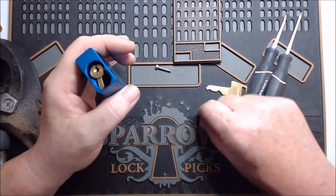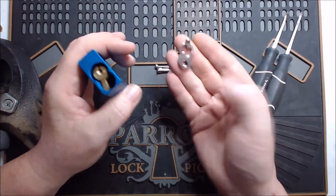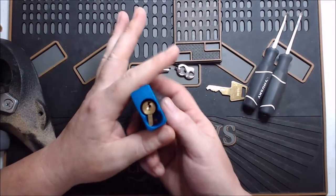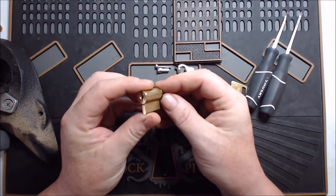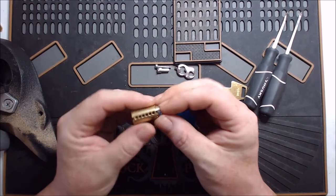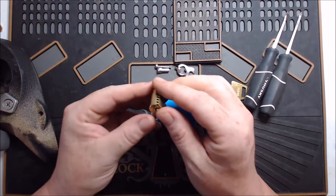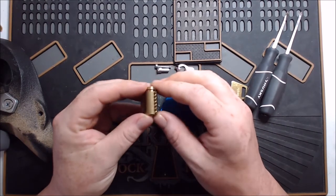This is the retaining cap that holds this plate in, which is just levered into the back of the lock. It just holds the core in. Otherwise it's a standard miniature core brass. It's got holes in the bottom, and when you turn the lock around the key pins will fall into those holes sometimes, which will also seize the lock. So just make sure when you're trying to get it undone that you're conscious of where things are and what it looks like.